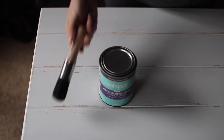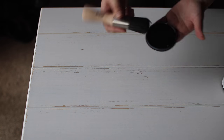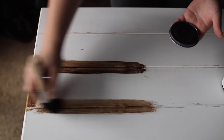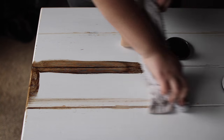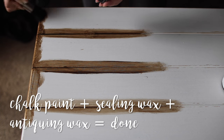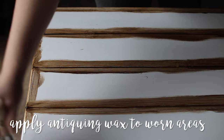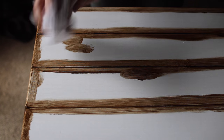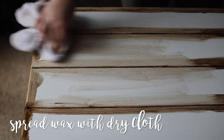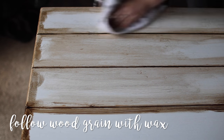I then moved on to the antiquing wax. This was my first time using any form of wax when finishing a project, and although it went very well, I may have technically applied this incorrectly. Thankfully this doesn't affect the end result of my project, but if you decide to use this method, pay close attention to the directions for your brand since it may vary slightly. According to the directions, I should have used the sealing wax over my chalk paint and then applied the antiquing wax. Apply the antiquing wax to the distressed areas and any parts you want to give more attention. Thankfully, if you apply too much, you can remove it with a damp cloth. Work the wax into the surface using a dry cloth and build the color once the wax dries. Be sure to always follow the wood grain and remember that a little goes a long way.